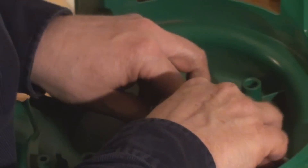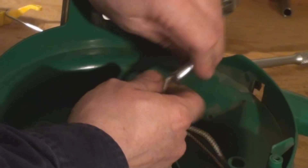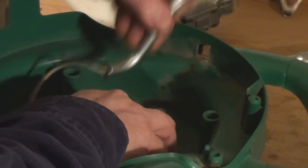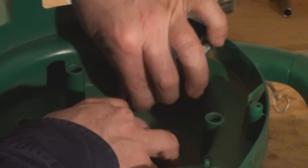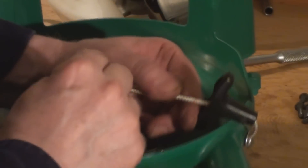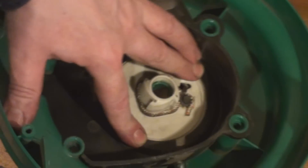I've got the cord as short as possible, wrapped around the reel. To preload it, go opposite from which it recoils — in other words, in the direction that it pulls out. Desperately trying to hold that spring in place with the butt of my hand. Okay, so that's through. This pipe passes through here. Push the whole cord out first within the pipe, and then we'll seat this end. So I'm going to shove that through the handle, pull it out a little bit. They had a regular stopper knot; I like to use a figure eight knot here. Cover on — it just drops in there like that, and that's what's going to keep the spring from coming out.